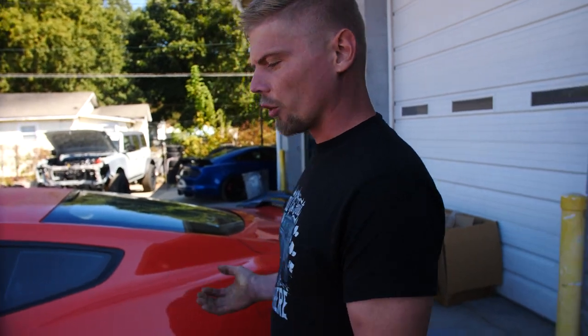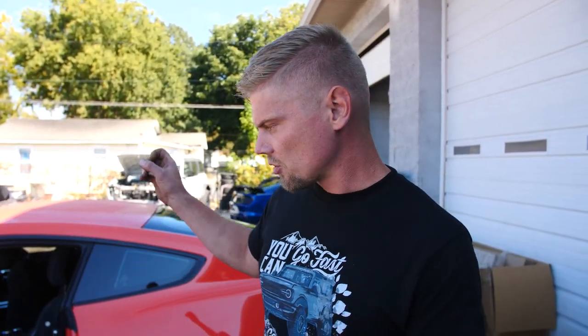You too. All right. So some of you guys might be wondering why the Mustang is still here. I was waiting on a new SRS explosive device for the steering column. But unfortunately, we could not locate one to replace it. So Mike actually told me that my airbags can reset the one that's in here. So we are going to pull the steering column out and send the little bomb to them and let them reset it, and then we'll get it back and it will be done. So let's pull the steering column out.